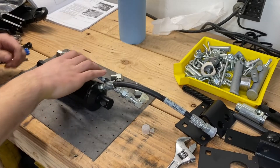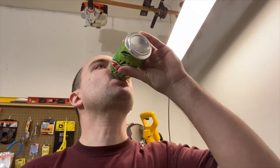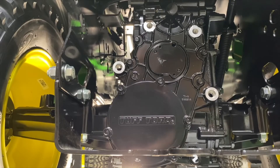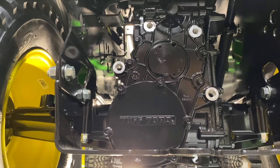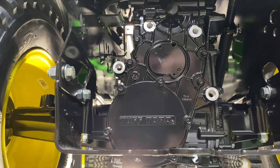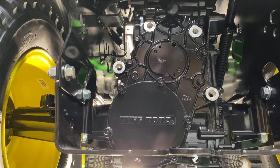The final step here is to rotate the cylinder rod cross hole until it is in alignment with the base end cross hole. You can see these two holes are kind of off right now, so just put a punch in there and turn it until it looks aligned. Looking at the back end of the tractor now, we're going to be installing the cylinder back onto the machine. Step 20 and 21: from the left rear of the transaxle, install the cylinder onto the machine bracket, install base end with the shoulder pin and spring pin.